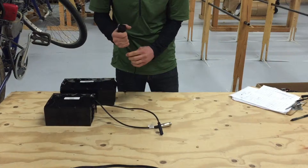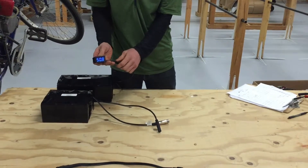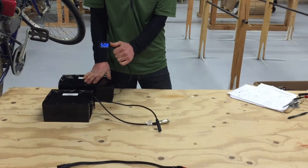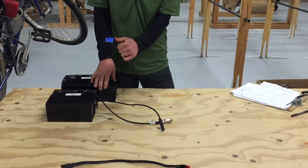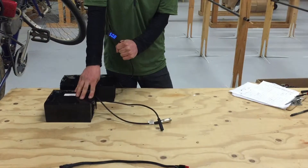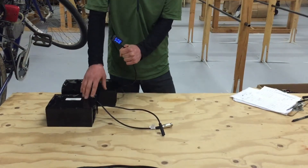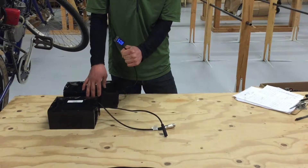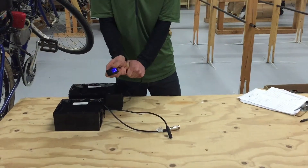For this 48-volt battery, we plug it in and get almost 51 volts — again, a few volts above the rated nominal voltage. If we were getting 46 volts on this 48-volt battery, that would be completely depleted. Similarly, 34 volts on a 36-volt battery is completely depleted — it sounds like a high number but the battery is totally empty. If either battery reads its exact nominal voltage, 36 or 48, that's about 10% remaining. You want to see a couple of volts above the nominal rated voltage.